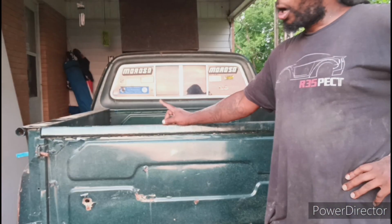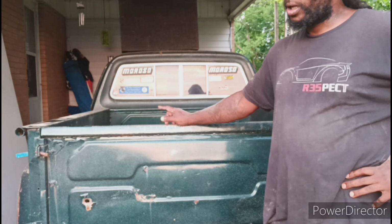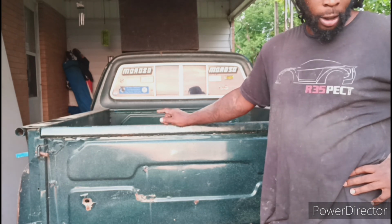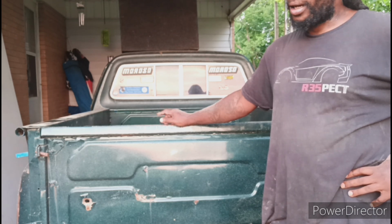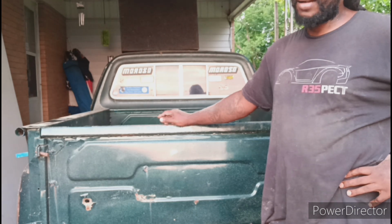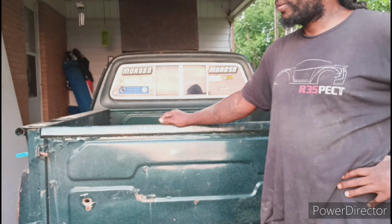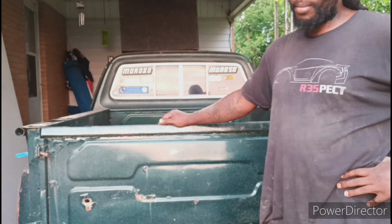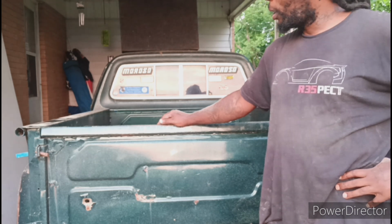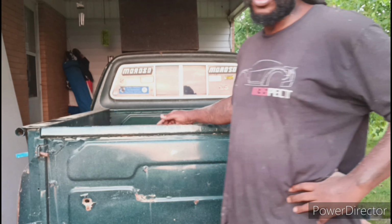And this fresh sheet here, all I got to cut off of the fresh sheet is a front, a back, and two baffles. And then I can start cutting the port. The port's going to be really long, and it's going to be L-shaped inside the box. And I'll probably do some 45s on the ported side, probably not on the sealed side, of course. Stick with me. I'm gonna go get me something to drink, and I'm gonna turn this thing back on time lapse, and I'm gonna go ahead and measure out that next sheet of wood and cut out that front and the back and those two baffles. So let's get it.